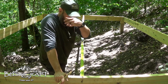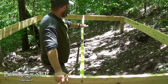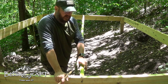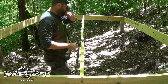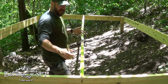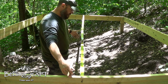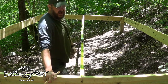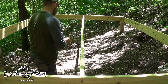Just in case anybody doesn't know, the reason you hang 16 inches on center is so that when you lay your plywood down — and we're actually doing the deck first, so it's a good thing I said this — your four-foot sheet of plywood meets up and then you have two supports in the middle of it. That's all it is. We're going to start from the opposite side, because that's where the subfloor is gonna start being laid.